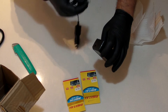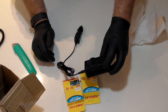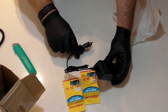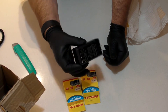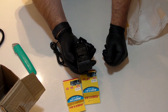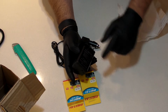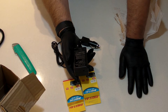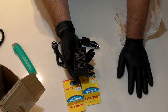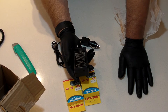What this does is give you the ability to charge your battery charger using your car. Or you can swing out the blade-type adapters. It's good for 100 to 240 volts, 50-60 hertz, which means it will work anywhere from Japan to the UK. It puts out 4.2 volts DC at 600mA.